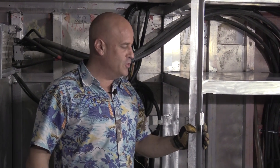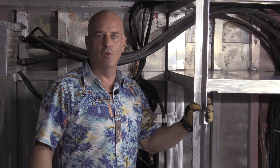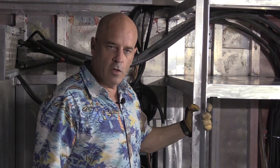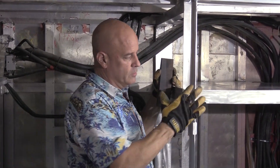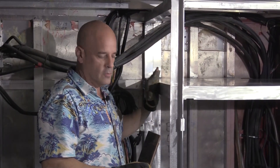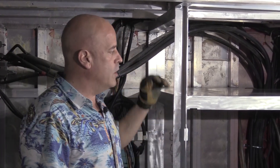Nothing is quite typical at yacht shops. Instead of making framing out of two-by-fours, we decided to do everything out of aluminum, keeping it very similar to the way the unit is built. This makes it a much stronger Faraday cage, a much more solid structure. Then we'll be applying birch plywood throughout over each area, with the aluminum to adhere to — similar to framing construction but done with aluminum.